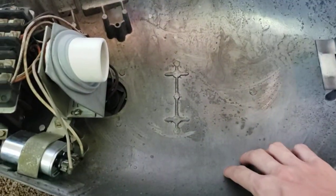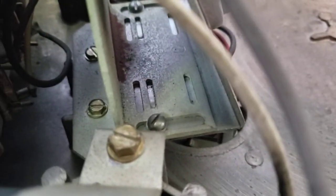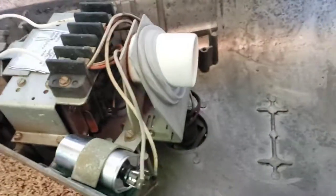Here's the reflector, and you just pull back on this tab and it comes out. The rest of the fixture interior I barely even washed — this is basically how I received it — and it's so nice and clean, almost perfect. There's the bottom of the photocell receptacle and some adjustments you can make to change the light distribution. There's the socket with the neoprene gasket around it, and some other shots of that ballast — it is a beefy ballast for a 175 watt mercury vapor fixture. This may or may not be a 120 to 240 volt fixture; I haven't checked.